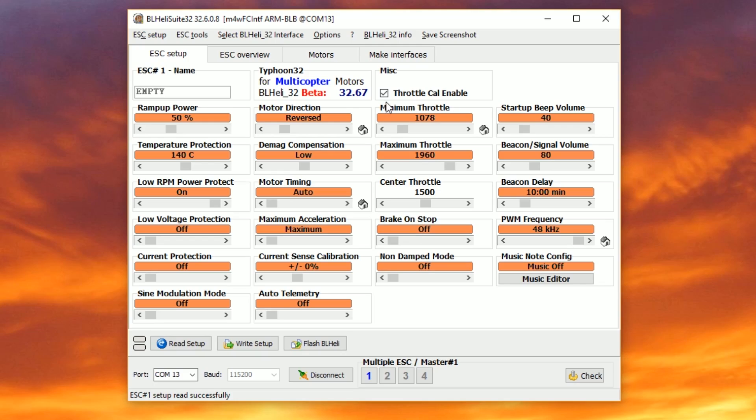The parameters that can trigger 'set up not in sync with master' — one of the most common ones is the throttle: min throttle and max throttle. If you're using D-shot, you actually don't need to worry about these at all. But way back when people commonly used one-shot or multi-shot, you would calibrate your ESCs, and the calibration would result in a slightly different min and max throttle value for each ESC. When you have a digital protocol like D-shot, you don't have to calibrate the endpoints — it's just a digital value. But with an analog protocol, you have to calibrate.